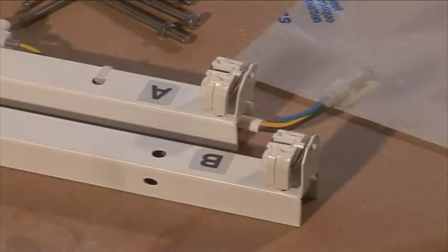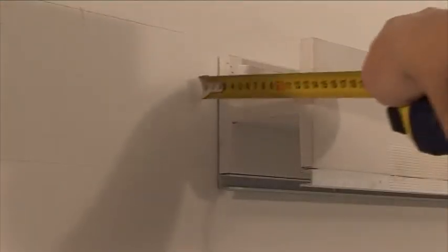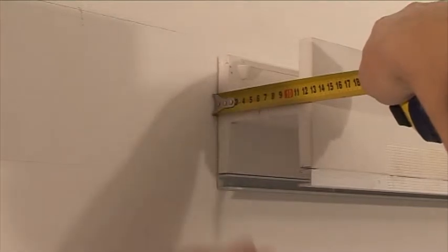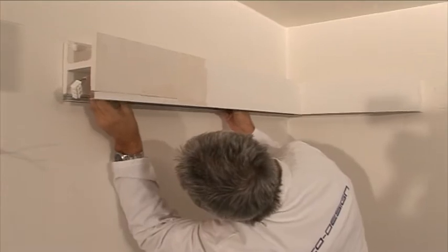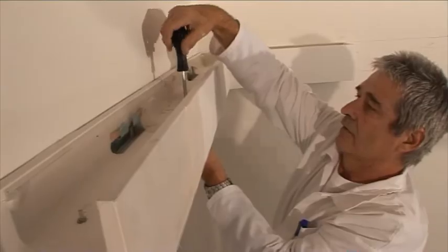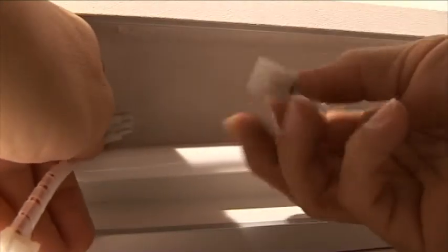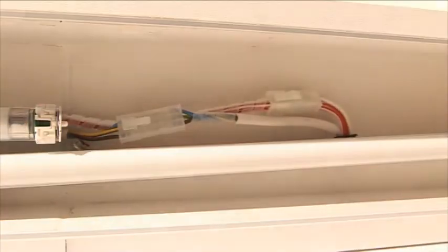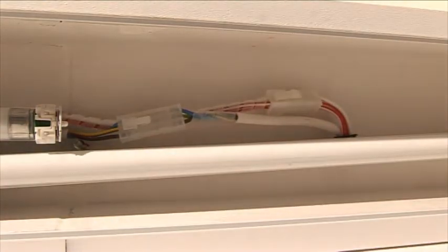Every part is held with 2 holders. Plan appropriate places where the holders are attached with screws, according to the length of the parts. Mark the holder center, drill holes and attach the holders with screws. Insert the electric equipment. Tighten the electric equipment holders. Connect the electric equipment and arrange the cables so they do not touch the bottom glass covers or lap over the cornice upper edge.